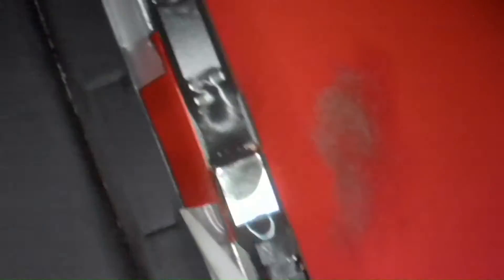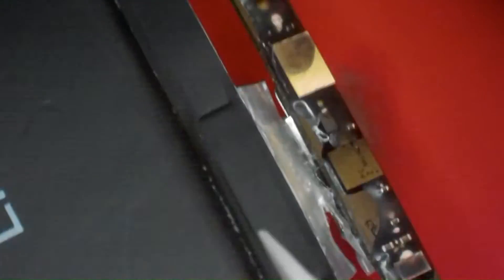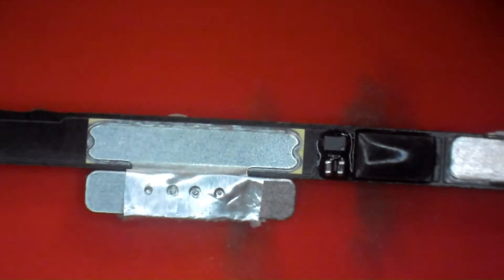Flip the battery over, reach in the same spot between the cell and the BMS, and clip that lead — you want to sever both leads. If you use long metal scissors and reach in like this, they can bridge the contacts and arc, causing a problem. Ceramic scissors won't bridge. Now we can see where our spot welds are — the leads from the battery have been laser welded to the BMS. There's a tab folded over so the leads are sandwiched between the tab and the pad. Pull the tab straight up and fold it back flat. You'll expose the original lead and can see the four laser welds.